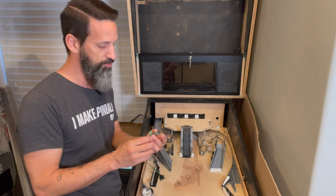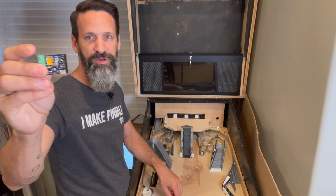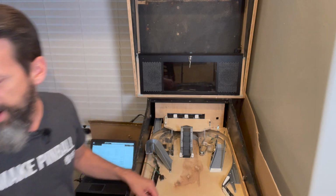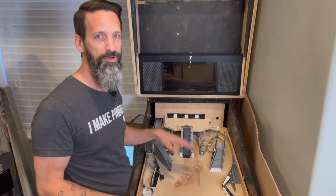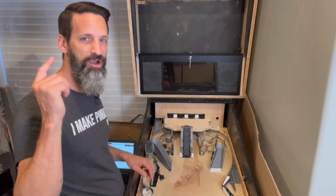They use a control board system that's called their Tic controller. I'm not sure what Tic stands for. Something fun, I'm sure. But this is an example of one of their Tic control boards. Okay, and what I recommend you do before you even bother hooking up your stepper motor into your pinball machine is start by taking your stepper motor, following the wire diagrams they have